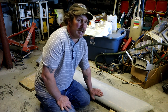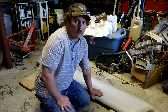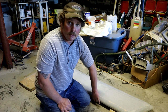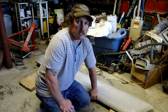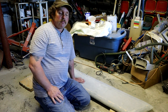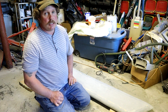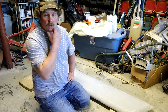On the airplane, that was the same layup for the wing or the control surfaces. Wrap it around and wrap it back. You'll end up with an edge that's underneath, so you have a little bump, and you'll have an exposed edge on the opposite side. Then you just feather it out and clean it up to smooth it back out again. I need to get a rag and wipe this clean with acetone. I'm doing my best to keep everything as clean as I can, and you can watch as I lay out this glass. Okay, I hope you enjoy it.